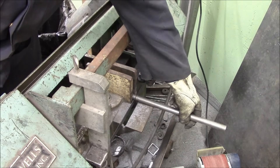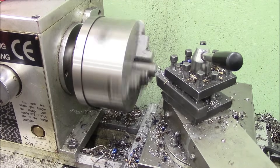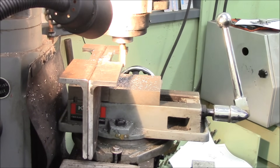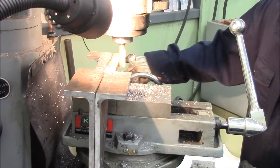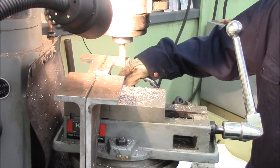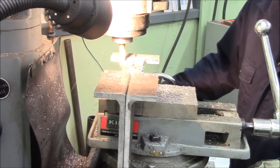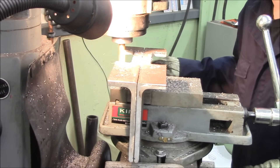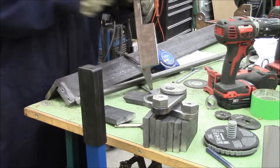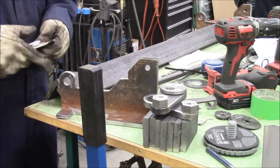These are the handles for the eccentric — face the ends and round them with a file. I discovered that the eccentric kind of hit the brackets, because my original plans don't include angle iron — they were drawn with something else. So I just sliced them open with the chop saw and smoothed them up with the mill. Then I used the mill to cut a little slot for the three-quarter inch pivot to go.